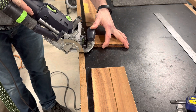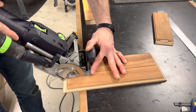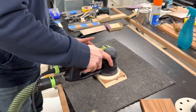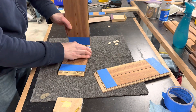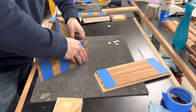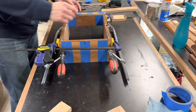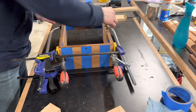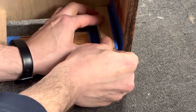Because the lower part of the box is wide enough, I used dominoes to hold the miters together. Before I could rout out the rabbets for my cocobolo edge details, I needed to temporarily secure the drawer face. I elected to use the old super glue and masking tape trick, and it worked well.